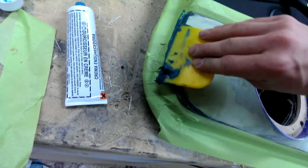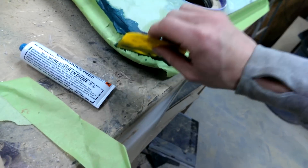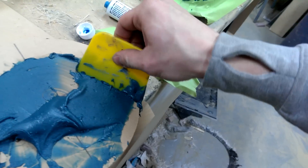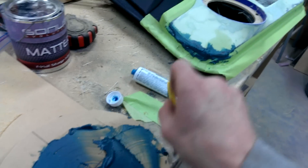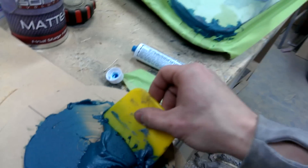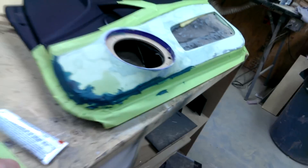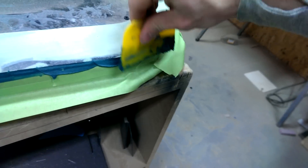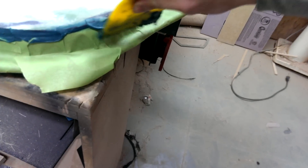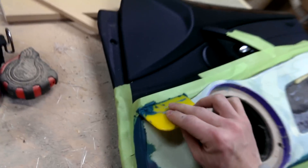Basically what you want to do is just shove it in the cracks. I like to pull it up pretty thick because this stuff sags a little bit — if you were using Vert you probably wouldn't have that problem, but I used it all. It's pretty important to go around the whole edge, even if it fits nicely — if it fits perfect, just keep going around it because it's just going to make it even better. You can always sand it off if it doesn't need to be there. I like to go around the whole thing, get it on there first before you really smooth it out, especially this area here.